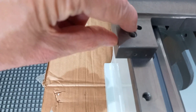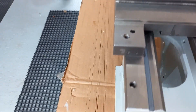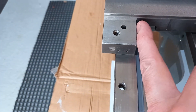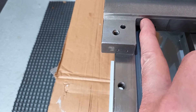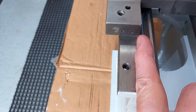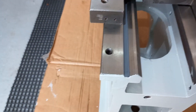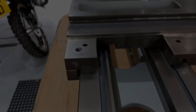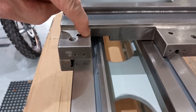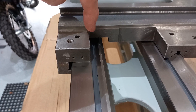The holes aren't in the center — they're over to the outside edge. It's like this edge has been cut too far back; it should be about there. My belief is that this edge has been wrongly machined an eighth of an inch too far to the rear. It should be here.